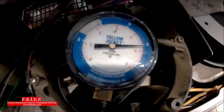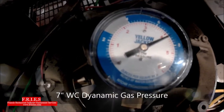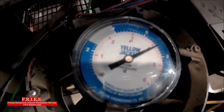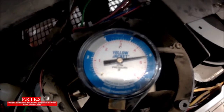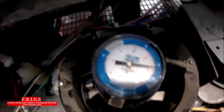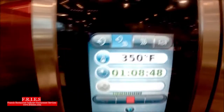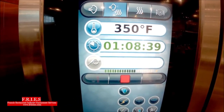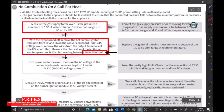Our static gas pressure is 8.2 inches water column — within range. What we're more interested in is dynamic gas pressure. We have ignition and we're down to 7 inches water column — that's dynamic pressure. We have about 20 to 25 seconds for flame sense. The gas valve just closed and we're back at 8.2 inches water column, which tells me we're having issues probably with the flame sense. Shortly after, the board logs error 88.